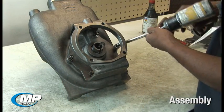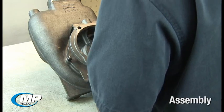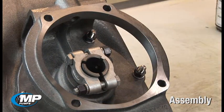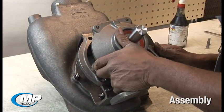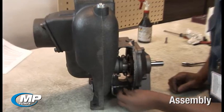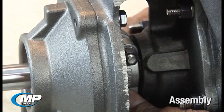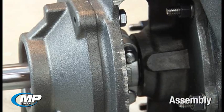When doing this, use caution to not contact the drive sleeve end with the stationary seal face, as doing so may damage the seal face. Install the drive sleeve clamp onto the drive sleeve and position it in the middle of the exposed drive sleeve length. Install the pedestal assembly by inserting the pedestal shaft into the drive sleeve and aligning the mounting bolt holes with the adapter holes. Insert and tighten the four hex head bolts to secure the pedestal assembly. The drive sleeve clamp bolts can now be tightened evenly to secure the drive sleeve to the pedestal shaft, which can be checked by visually inspecting the gap between the clamp halves to ensure even tightening.